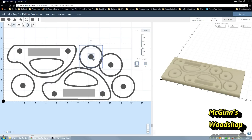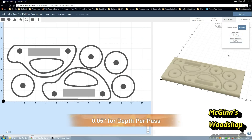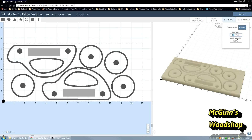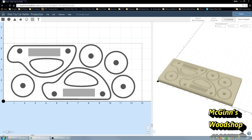I'm going to move this wheel just a little bit, just so it's off of this other wheel — I'm just trying to prevent any overlap. We want to check our bit size to make sure that's correct at one-eighth inch, unless you're customizing. For cut settings, as long as you have the DeWalt DWP 611 or a good router on your X-Carve, you can go 45 inches per minute or higher. If you have the original stock spindle, I'd recommend going to 37 inches a minute, or pushing it to 40, and change your depth per pass. With the DeWalt on my X-Carve, I push it to 45 inches a minute and depth per pass at 0.07. So now you have all the settings and should understand why the settings are what they are.